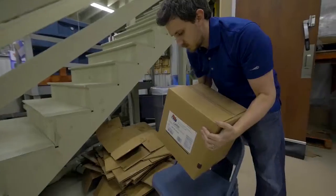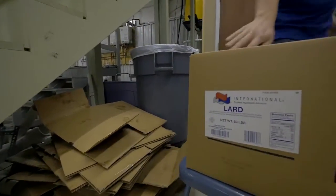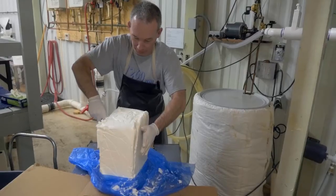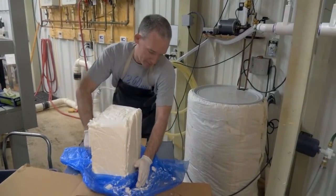Today's test is a rather strenuous test in that it's 100 gallons per minute, using 160 degree hot water, and it's 20 pounds of grease lard at a time being administered in 200 gallons of water — batch after batch after batch. This is far more strenuous than we'd see in any restaurant.